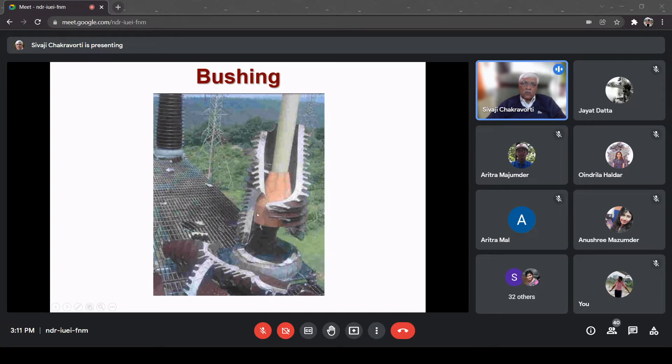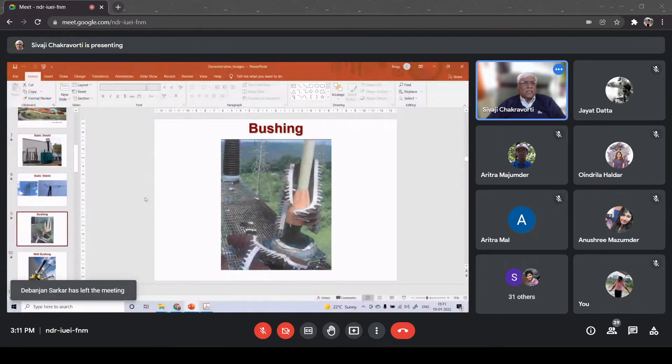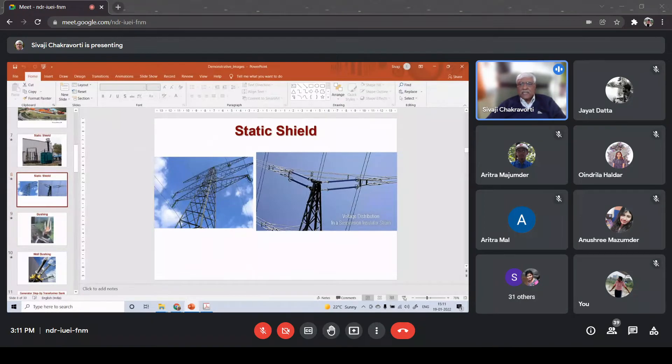At the bottom you can see a conical structure. This is typically used in this sort of bushing or even in cables where these connections are made. These are also called stress cones. Stress cones help in distributing the electric field much more uniformly, because this is the most critical part where the high voltage conductor passes through the tank. Since the tank is at zero potential, most of the failure occurs here, so stress cones are used for making the field uniform.